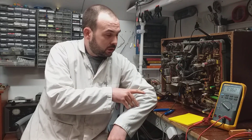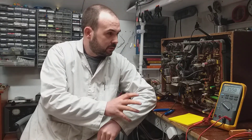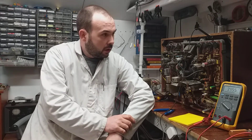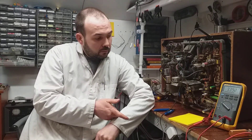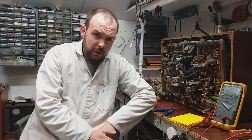What I find with these Bush sets is the resistors are always way out of value - they go sky high, especially the 680k's, the 270k's, the 470k's. Anyway, we checked the 680k in the line hold, just coming off the line hold control, and it was reading 1.7 meg so we replaced that. Because we had the set going yesterday for quite a while, I thought the electrolytes were probably alright, so I just plugged it in and it blew the fuse.